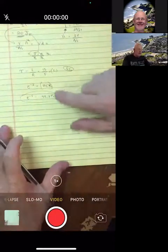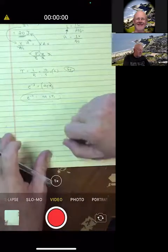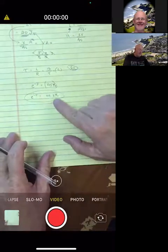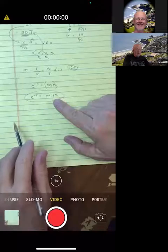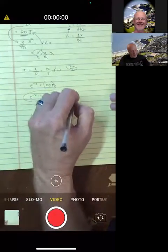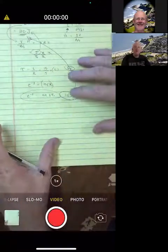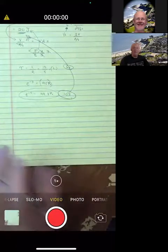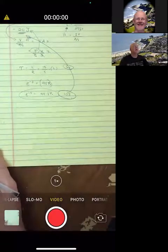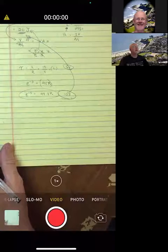All right, so a better statement is not 3 time constants. That's still 5% off. But 5 time constants gives us really close, 99.3% of the way there. All right, so 2 times 5 is 10 seconds. So maybe I should say after 10 seconds, we essentially have now completely energized the inductor. We now have 20 joules of energy. Good to go. We can say it's completely full and the current is now stable after 10 seconds. Nice. And like I always like to do, let's just check 20, 0, 20. Nice. All right. So that one seems straightforward enough.